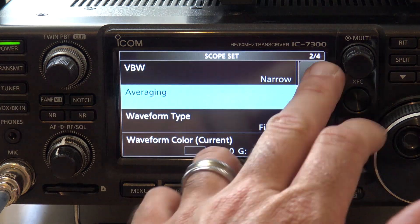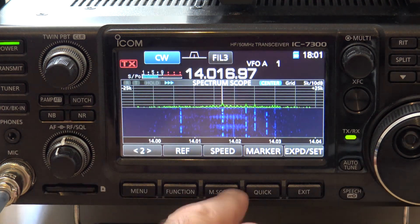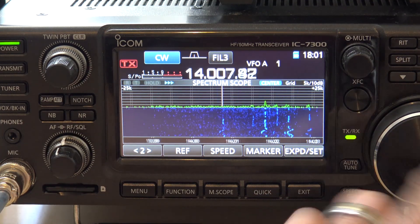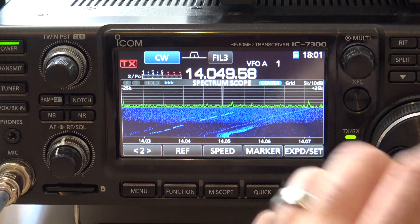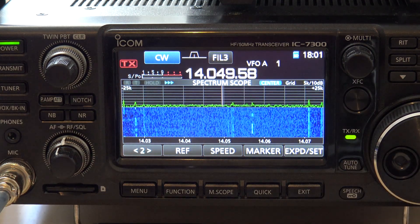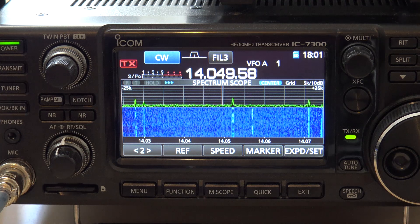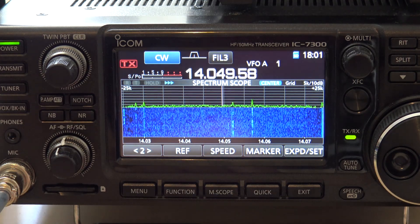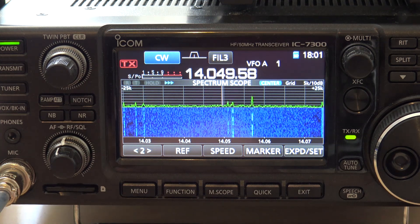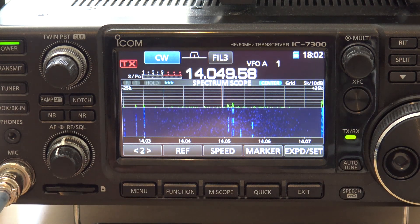And then we can also go to ABS frequency here — now we've got the frequency on the bottom and the whole thing moves. There's your FT8. So that pretty much gives you an idea of what you can do with the scope and how it makes it easier to find signals. There's probably a lot more you can do that I haven't shown yet, but it's an idea of how to change that waterfall and make it so you see the CW stations and tiny things that aren't on your scope — you can dial them in, zoom them in, and find them so you never miss a contact when you're in a contest or hunting countries. Makes it a lot easier on the 7300. Thanks for watching — KJ4YZI.